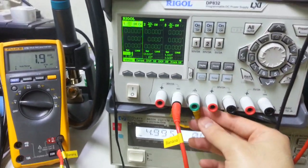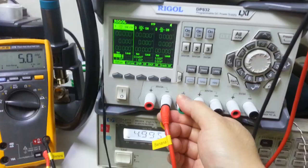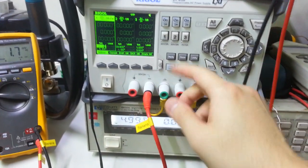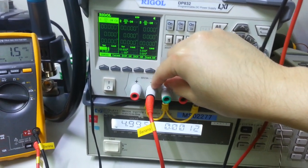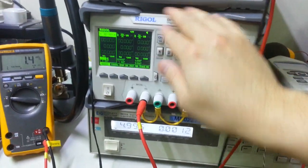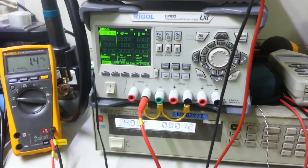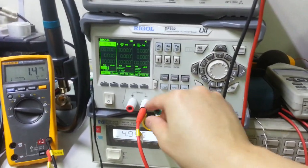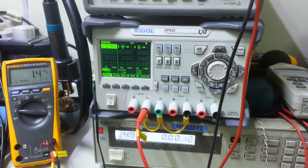But who would buy this power supply and connect all DC outputs to ground? I have never seen this practice. And for this power supply, they don't even provide a shorting or connecting plane — you have to do it yourself if you want to make any ground-referenced measurement. I think this power supply is not truly isolated or floating. It will create a lot of trouble and could kill your product, kill your circuit, if you try to do any measurement referenced to ground. The 30-something millivolt AC will directly damage anything sensitive.